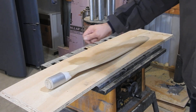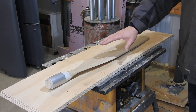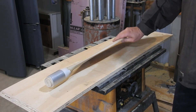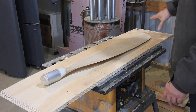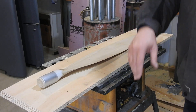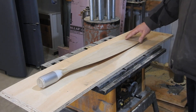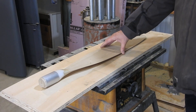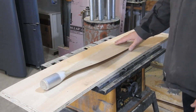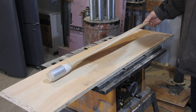I'll probably use a gel coat finish to cover everything. The first layer would be a gel coat brushed on, and then once that tacks up I'll start laying layers of fiberglass matted cloth on here to build the top mold. After that section cures, you flip the thing over, take off that plastic piece that was on there, then re-wax, PVA it, and lay the bottom section of matted cloth. Build it all up as thick as needed to make sure it's strong enough. Once that cures, you should be able to pop the mold apart and pull the pattern out, inspect the mold, make sure there's no imperfections, touch up if needed and sand. Then it'll be ready to start laying the fiberglass.